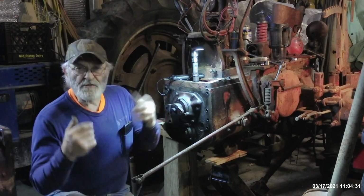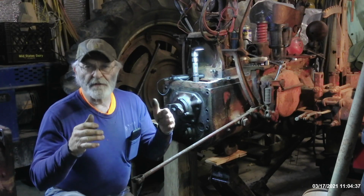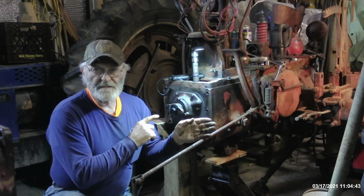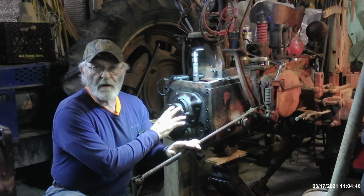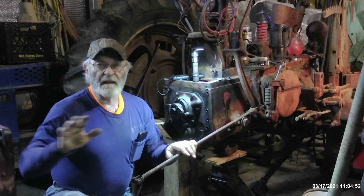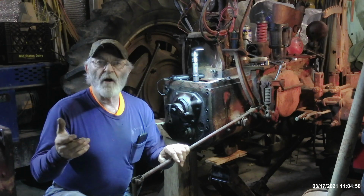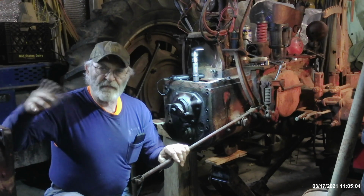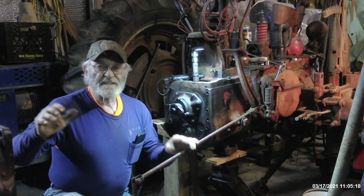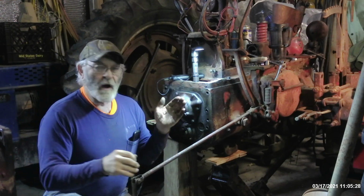Normally, like I said, we usually have these on the overhead hoist where we have chain falls that allow us to support the 2 sections and then roll one forward or the other backwards. Typically, I'll roll the back end backwards because it's supported by a choker and by a chain fall on front, and I've got the leverage of the rear wheels in order to rock and roll it to the rear, and leave the front portion of the tractor attached via a chain fall or a come-along hoist to another immovable object so that the front end doesn't roll backwards with me. But then what I'll do is easily adjust the tension by the come-along hoist that's hooked to the truck, and just slowly put pressure on it and watch it slowly separate.